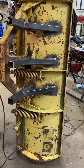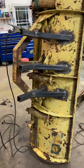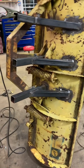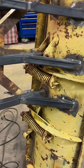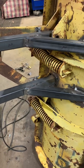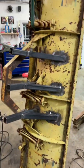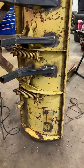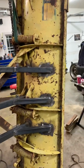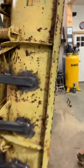Alright guys, who said I can't weld out of position? The answer is you just move the welding piece to a position you can weld in. Anyway, all the braces for the snow pusher are now burned in completely - full weld, 7018 eighth-inch rod running about 110 amps on the plow. She's all burned in. I need to pick up the steel on Monday to do the side wings and the braces, which are going to go up in here.